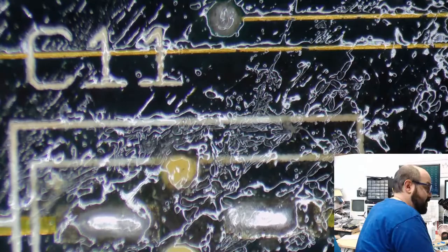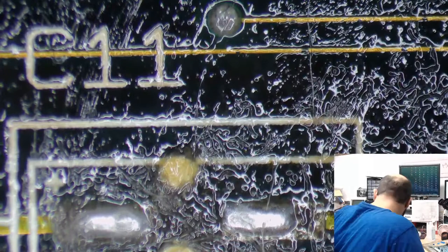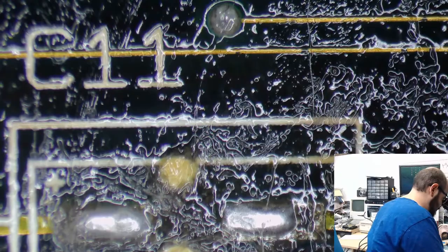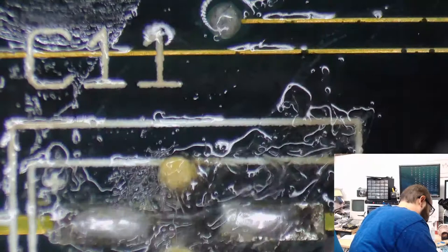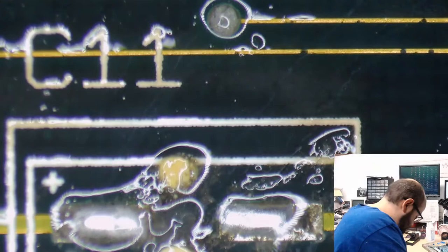So, unfortunately, I can't replace the batteries right now. But what I can do is replace everything else, and we could wire some batteries temporarily to jumpstart this machine. Because without those PRAM batteries, one is for keeping the clock and one is for powering the machine up, you can't power the Macintosh 2 up without those batteries. You need to compensate somehow. You could do that by jump starting it, you bridge two pins on there, and it will jump start it. But it's best to actually have a replacement there where you can get everything proper.